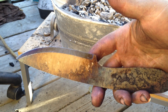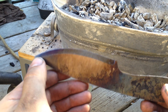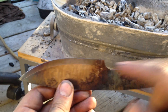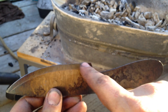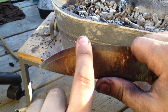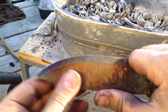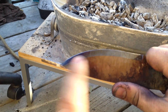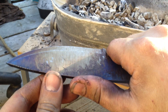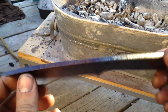It went a little bit further than I wanted — the edge at the point went a little darker than I wanted, into the purple. But it's light straw in the cutting area where you'll do all the fine work, and then it gradually decreases in hardness towards the tip. It went a little further back than I wanted, but I might just leave it the way it is.